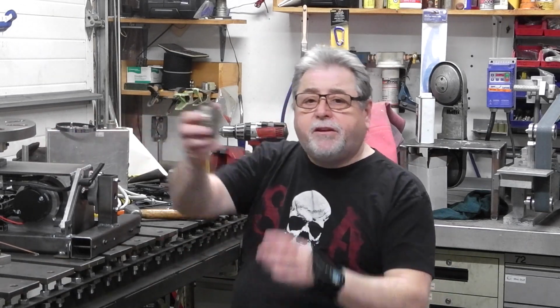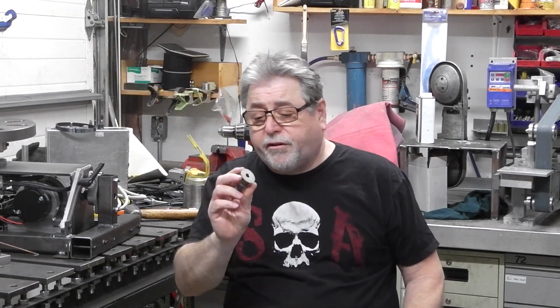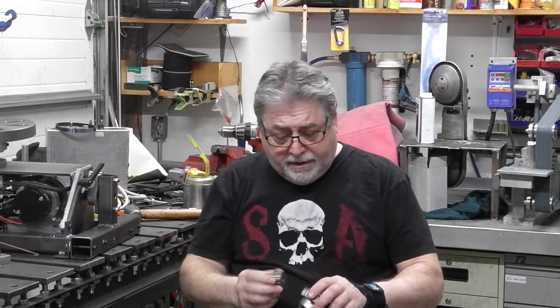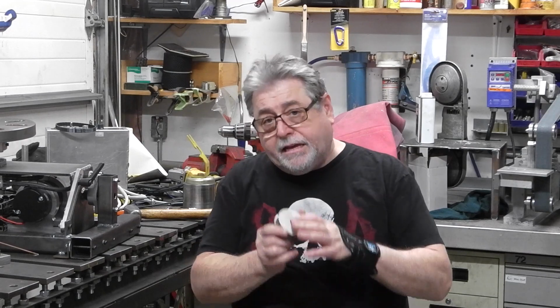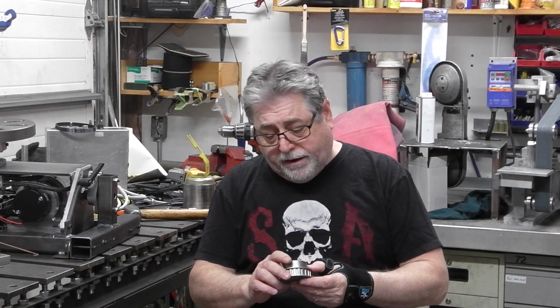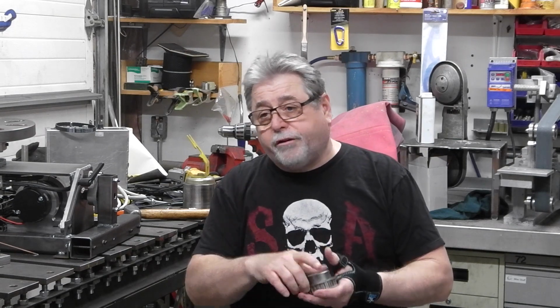I'm Fred. So with this video, I got my timing gears from my supplier, Ontario Belting. Right here. All we've got to do is put a keyway in here. I'm going to put it on the press and broach a keyway in this for a 1/2 inch. So without further ado, let's get to the press. All right, hang in there.